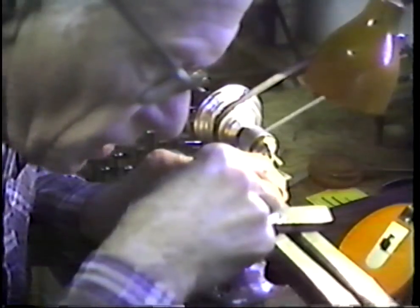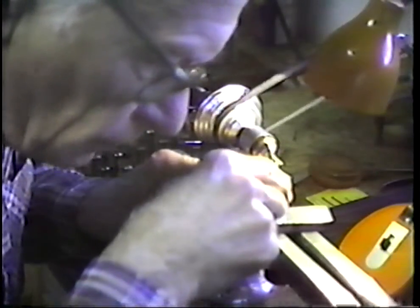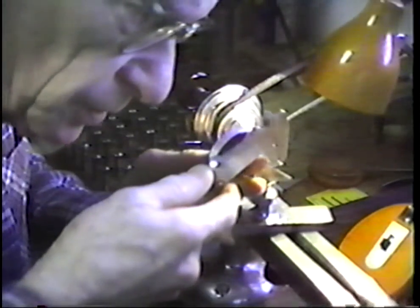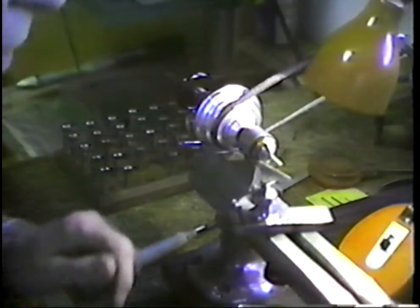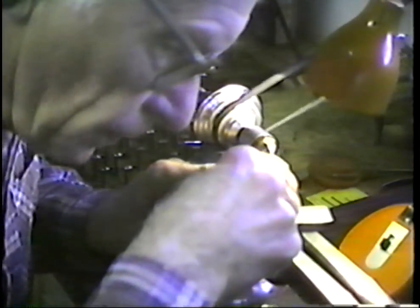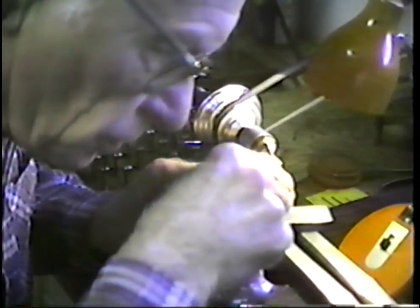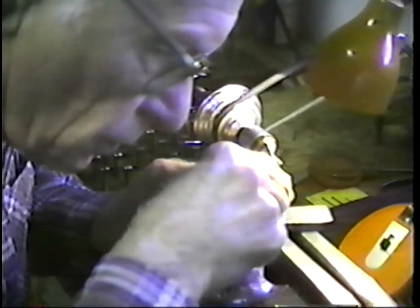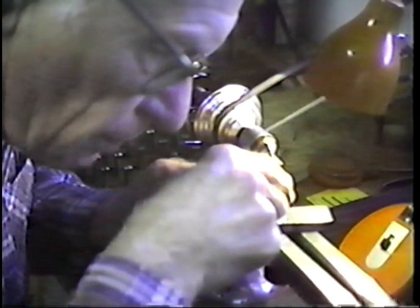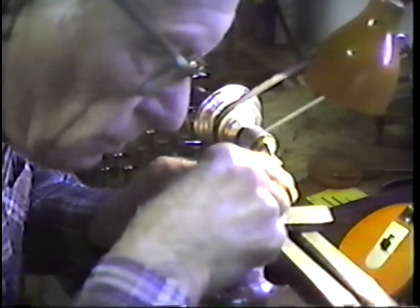This piece of stock is indeed hard. I have in the tools over here some carbide tool bits, tungsten carbide bits. I use these frequently, but a tungsten carbide bit definitely is not a general utility tool. There are many things that a good steel tool bit is more suitable for than the tungsten carbide. Of course, there are certain materials that require the carbide bit for cutting.